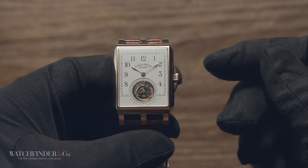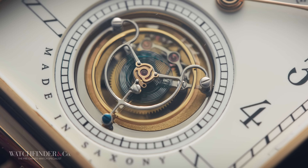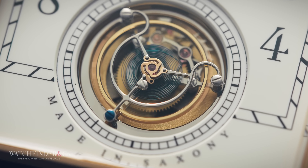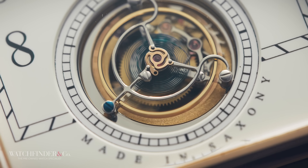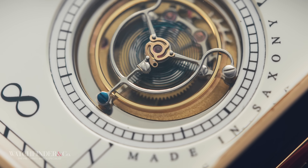The escapement is like the interaction between the wheels and the ground in the toy car, controlling the speed of the movement. Except instead of the entire thing being the mass it has to move, there's a much smaller mass instead — the balance wheel. The balance wheel spins around like the wheels of the car, but with no real weight to control it, so a smaller spring, the balance spring, is added to add resistance.